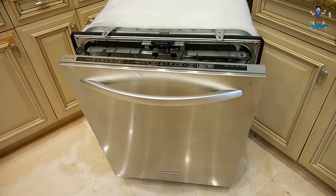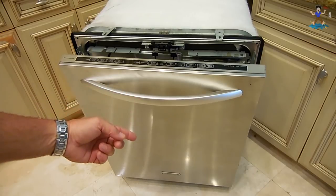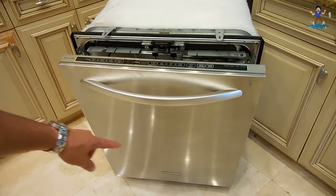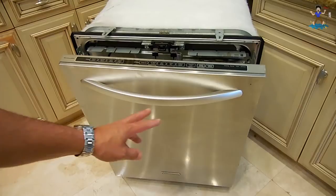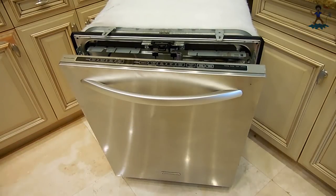There was a total loss of power and they also noticed a burning smell. So what I did is I checked for power at the bottom of the unit where the wires are connected. You remove the bottom plate right down here, probe the AC wires — the black and the white — make sure there's 120 to 125 volts, and there was that voltage present.